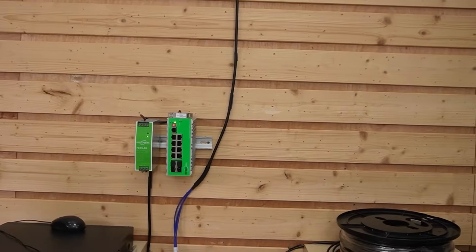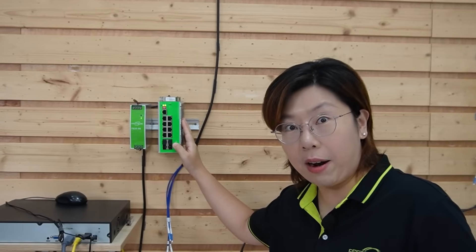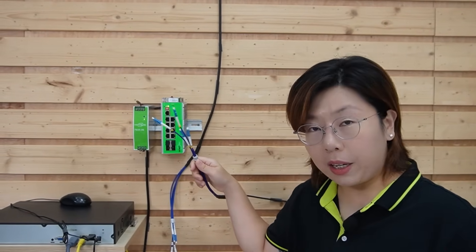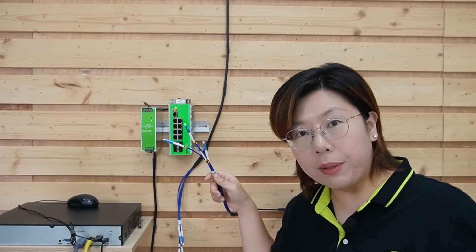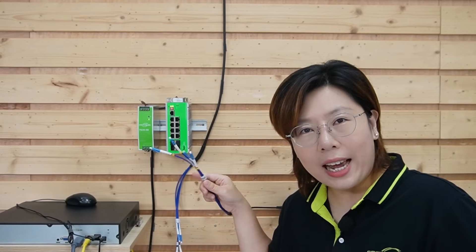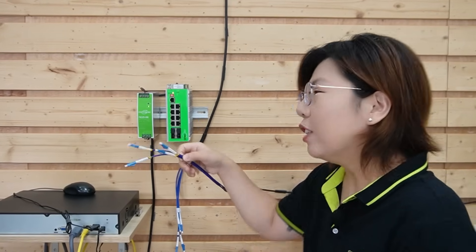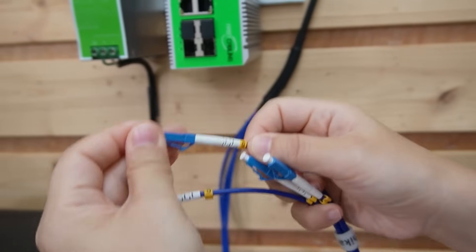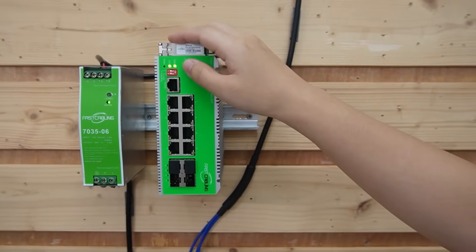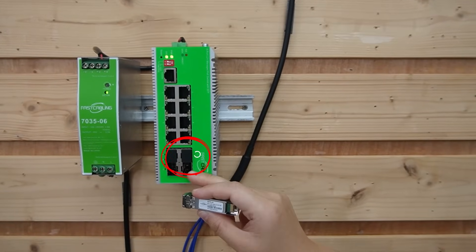Here at our industrial switch — this is our control room — we'll connect all switches in the ring using fiber optic cable. When it comes to choosing fiber for long-distance setup between buildings, we recommend single-mode pre-made fiber optic cable, because they're designed to cover hundreds of meters or even kilometers without signal loss. The pre-made ones are super convenient — you don't need special fiber tools or termination skills, just plug and play. To achieve full 10G performance, we'll need the 10G SFP+ transceiver installed in the SFP slot. This module converts the electrical signal inside the switch into light that travels through the fiber.